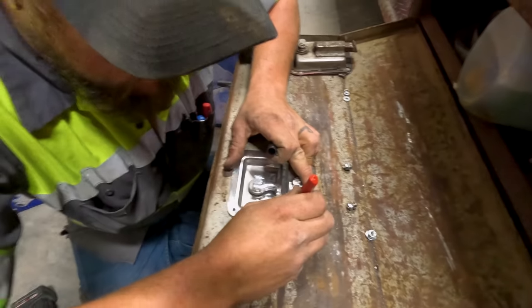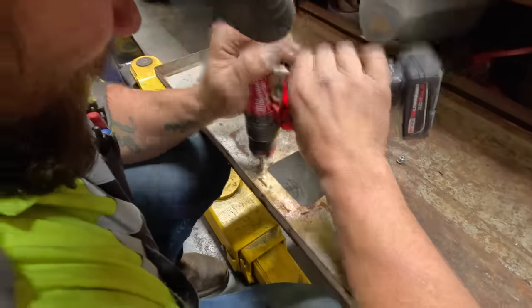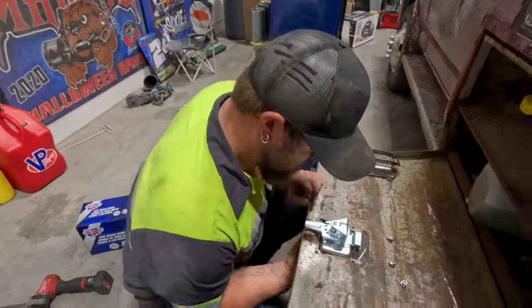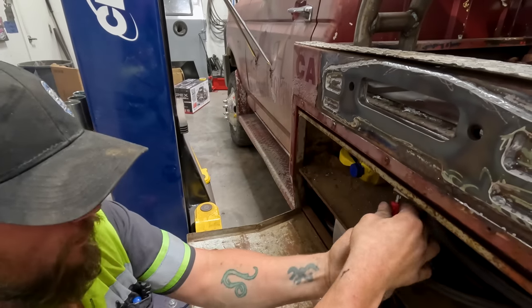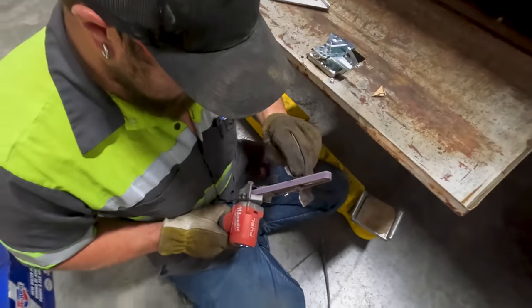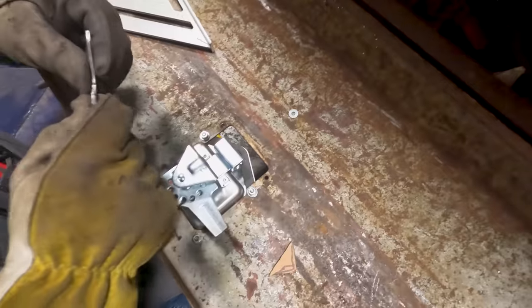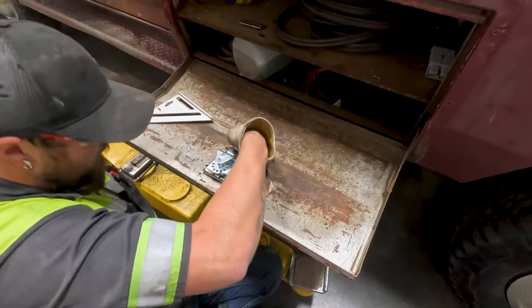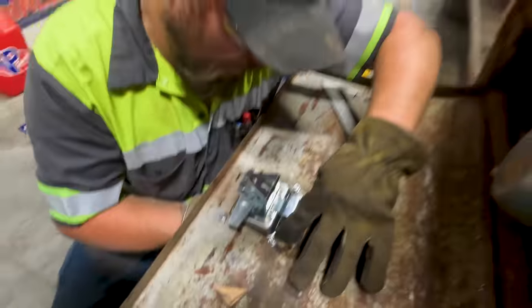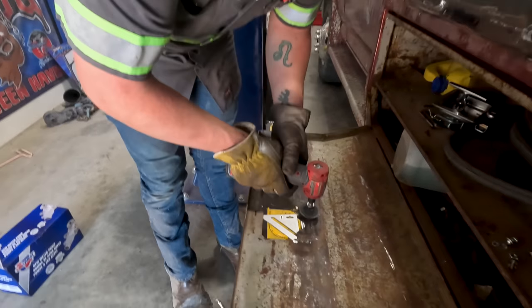The new latches that Damry ordered are here — I'm going to get that changed over. I got the old one out and the new ones put in, but I'm going to have to modify this door a little bit for this one. Now that I've got the opening where it needs to be, I've got to re-drill the holes so I can bolt it down. I removed the original latching plate and the spacers are built so the new latch will actually latch. I filed the filler plate to fill in the hole and now I'm fine-tuning it — I've got to grind a little bit more off the inner part so it clears the bolt. I got the filler plate all welded in, now I'm just grinding it down so it's flush.